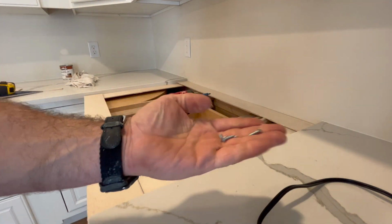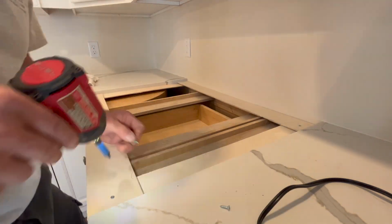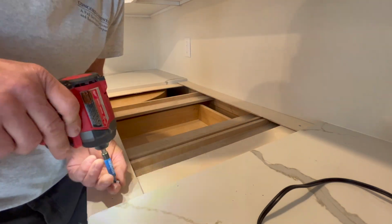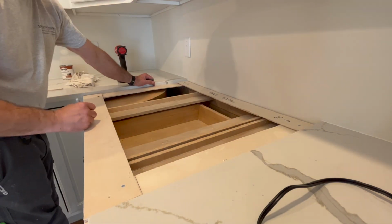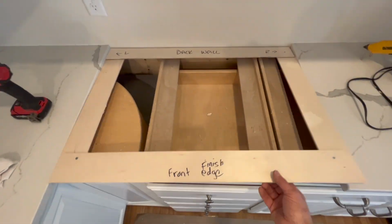I connect my parts with hot glue, and once that glue is dry, I place a few short screws into the corners for reinforcement, especially if I'm transporting it. I use pencil marks on all the intersections so that I know if anything moved. It's a good indicator. I also mark front, back, and sides, so when I go back to the saw, I don't get confused.